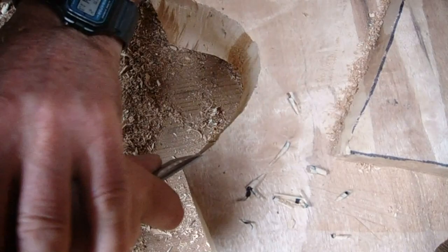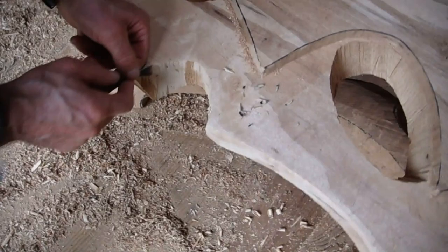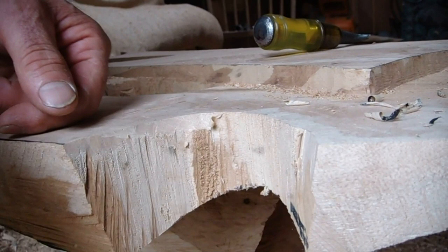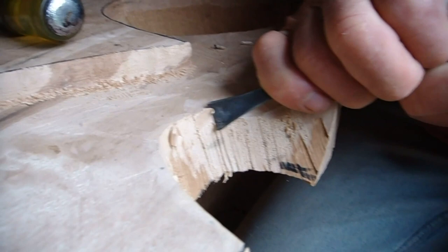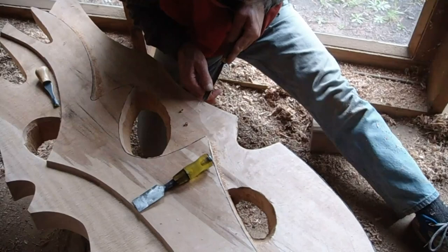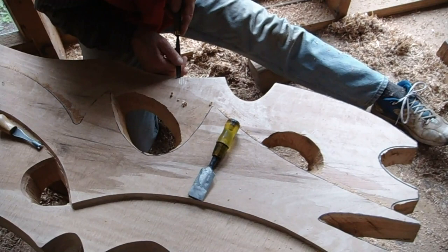I can get it started with this chisel. Now I have to use a different chisel — a little chisel with a curvature so that I'm able to get into that curve without digging. The whole time you've got to be paying attention that you're getting the curve you want; you've got to be looking at the whole curve. Okay, so now I've got a nice curvature. Now that all the shapes are defined, you can start chiseling there.